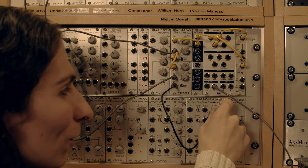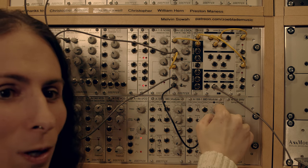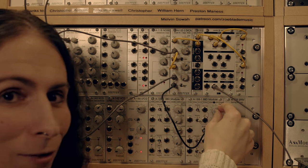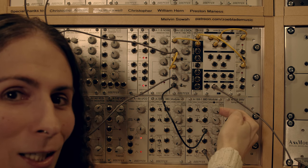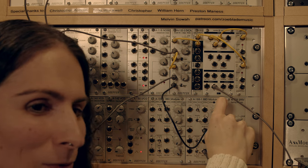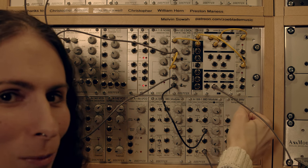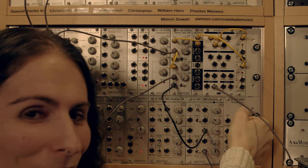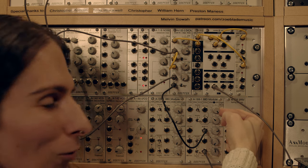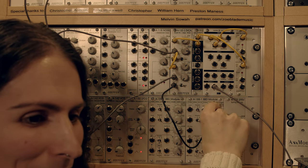And when you do that slowly enough, say less than 20,000 times a second, it's slow enough that you can hear it. And I believe with most BBDs, that clock signal will have a notch filter or a low pass filter afterwards, so that you won't ever hear it. Not this one, because this is a really cheap and basic one. It's actually one of the things I like about Doepfer's modulars generally, is they tend to be a bit cheap and cheerful and imprecise, and they have so much character, bags of character. But in the case of the BBD, it may occasionally be going a bit too far, because clients might complain about that. So that's what that whine is.